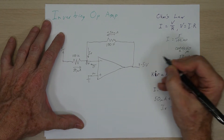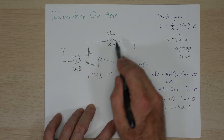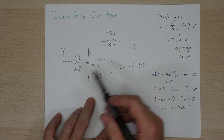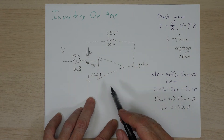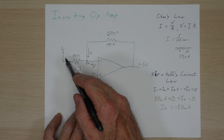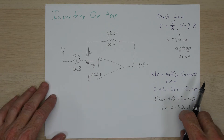So we can infer that the output will be negative five volts. As you can see, the 100k ohm resistors give unity gain to the circuit — by using the same resistor value for input and feedback, it will always track with a negative voltage. Whatever your voltage input is, you'll get the negative voltage out in this particular inverting configuration.